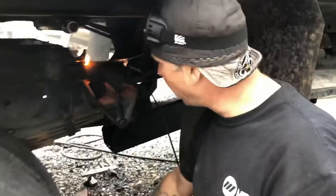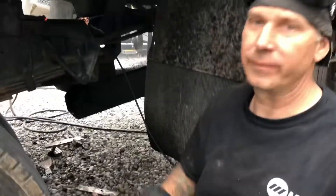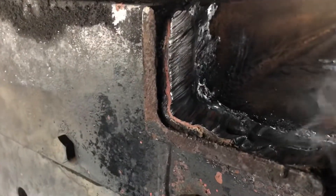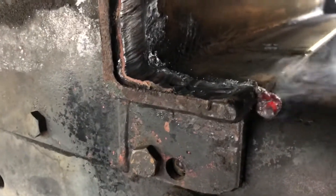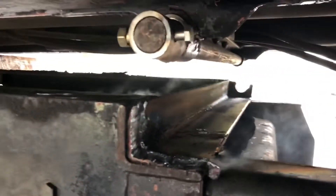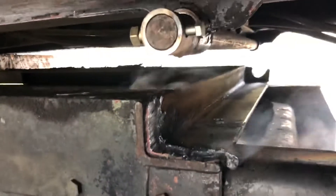Wow, this is pretty great — this had no problem slicing through that half-inch plate along with the weld that was on both sides, so we were able to get that cradle out of there no problem. You can see where we can go back through there with our gouging tip and not have a lot of gouging to do — we could probably even grind that out fairly quickly. But I'm really excited to go ahead and try that gouging tip. We'll do the other side the same way, put our new cradles in, weld them off from both sides, and get this truck hauling cars again.